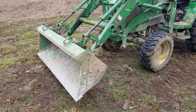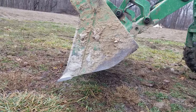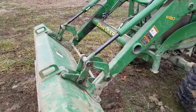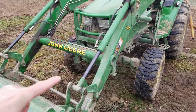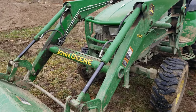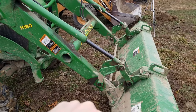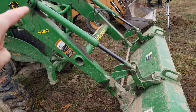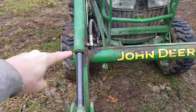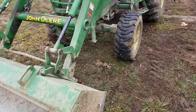As I described, this is likely the position that most people would use when back dragging, or would want to use. You've got this leading edge of the bucket out here kind of as your blade when you go backwards. The point that most of these other videos make is that now this cylinder is full of fluid because it has pushed the rod all the way out - making it weaker because you have more extension, but more importantly, if you were to hit a stump with the bucket as you're back dragging, the mechanics of it are going to want to force that rod into that cylinder and that fluid has nowhere to go because the valve is closed. So something has to give and on these smaller cylinders, you're likely going to crack or bend something. So that is what most people are talking about when they say don't break your loader when you're back dragging.